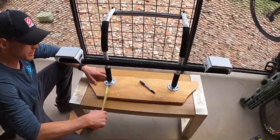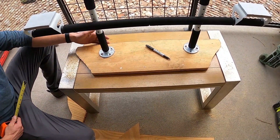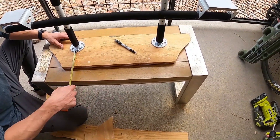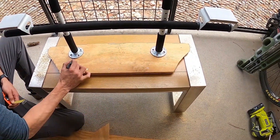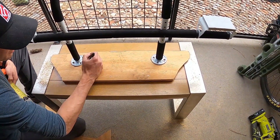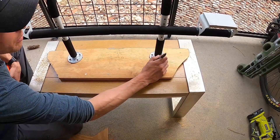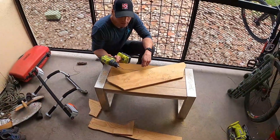Pull the flanges apart to make sure they sit flat. We measured up about three and a half inches from the factory-cut edge — we chose that side because it's the cleaner cut. Then we measured in from the side, approximately five inches on both sides. Mark your holes, put a little dot right in the middle of each flange position.